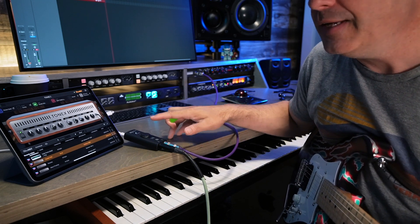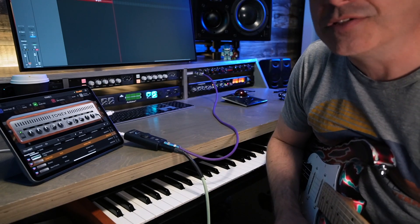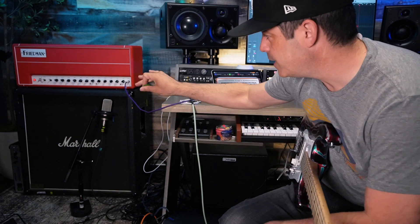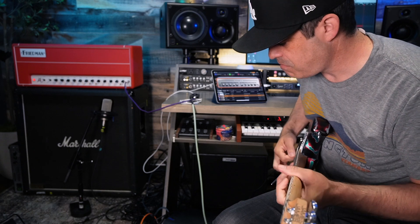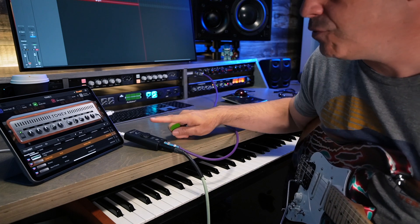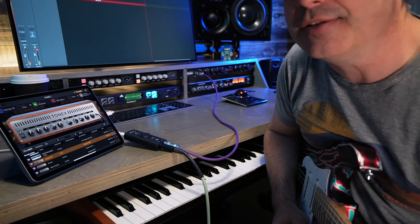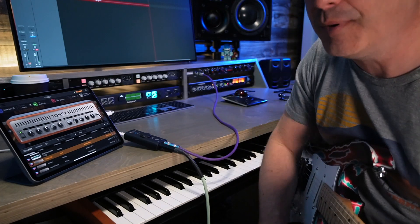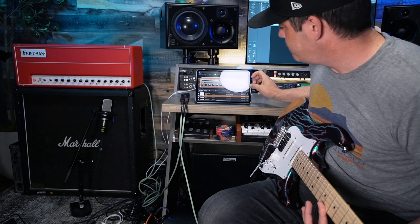Another use for this is I can run this directly to the front of my guitar amp. This is the DI coming straight through, so we're hearing just what the actual amp does. I could also run this processed signal into the effects loop or to the front end of a clean amp. Now I'm taking the amp out into the effects loop, so what I'm hearing is my digital front end from Tonex going into the tube power amp through the speaker.